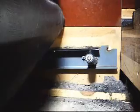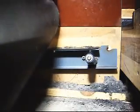So I'm pulling up in the middle, and it pops it off of both of these centering rollers right here. Hope you're in the right position to see that. Now I'm just going to fold the mat in half over itself, and I'm going to pull it out from the sides where I've taken off both the T-band belts.